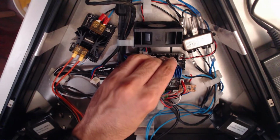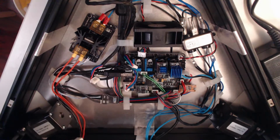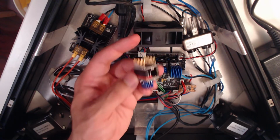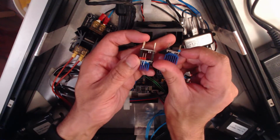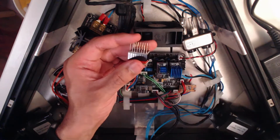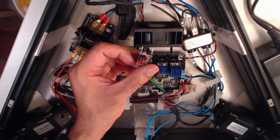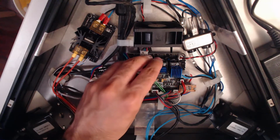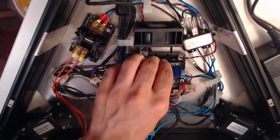Okay, it's not super happy with the way that these silent step stick things sit in. They're not very secure because the pins are so thin compared to the ones in the actual driver boards, which are much thicker. You can't really see it on camera, but they are razor thin, and I'm guessing that's why they're slightly bent, just to make sure that they clamp into place a little bit, a bit more friction. But we'll see how it goes. Makes a good enough connection not to be an issue.